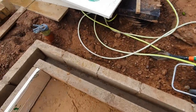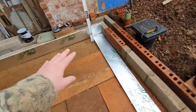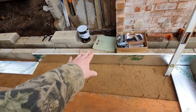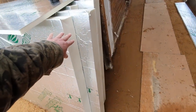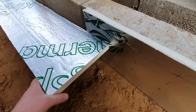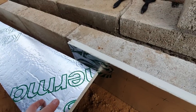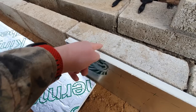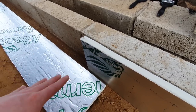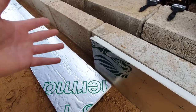This is all taken off the architect's spec - those in the know will know. What we're doing now is cutting some insulation for the cold bridge that goes around the external wall, and inside we've set this insulation upwards like that. Inside we'll be having some 100mm insulation go down underneath the concrete floor, which will bring us up to this height. So we have insulation below, and then on top of that we'll pour concrete to the level of this block. This section prevents any cold bridging across from the external block into your concrete floor, so your concrete floor is basically insulated on the bottom and sides from any external heat loss and thermal transfer. The heat in your house will then warm your concrete block up.